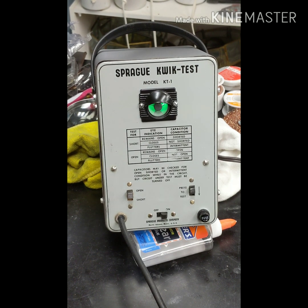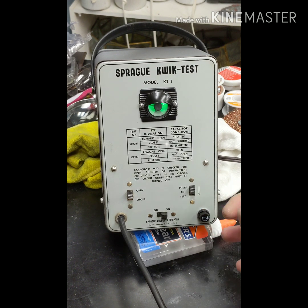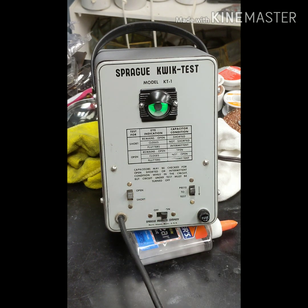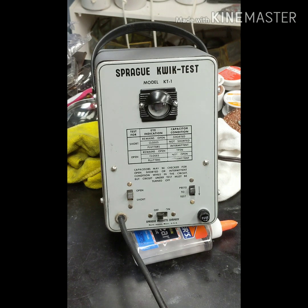I just think it's cool - the eye tube on there. I've got it so it's fully functional the way it was when it was new in '52. The other thing I did that I didn't mention is I added a 2-amp fuse in front and put a new polarized power cord on it. So this is good to go - it should last somebody another 50 years. We'll turn her off and we're done.